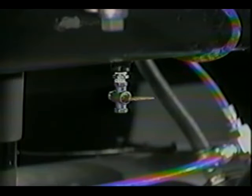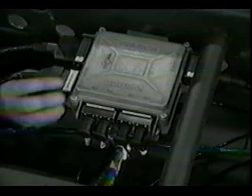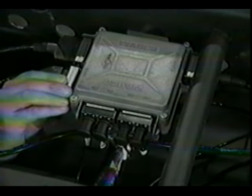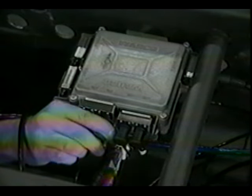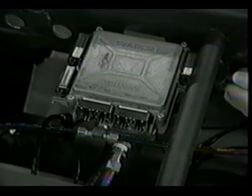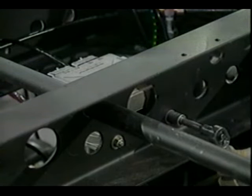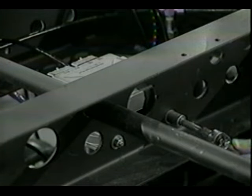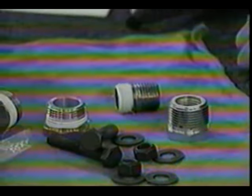As before, release all pressure from the air system before attempting to remove these components. At the ECU, disconnect the diagnostic connector cable, the power cable, the wheel speed sensor cables, and the electrical cable to the modulator valves. Remove the airlines. Label them for installation. Remove the ECU valve assembly. Like the ABS modulator valve, it can be mounted by bolts or on a mounting pipe nipple. Reverse the removal steps to install the ECU valve assembly.